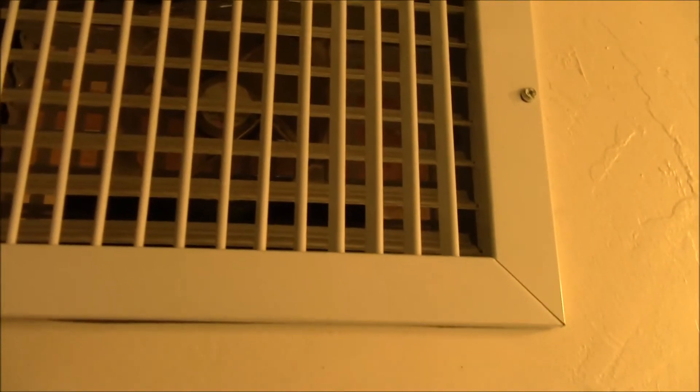I have the vent over the door — there's the door frame and the two fans. That helps the heat because I used to get a lot of hot air trapped behind this point. Hot air rises, and this area behind the door would fill up with hot air before anything would come out below. Now I have these two ventilation fans above the door that blow the hot air almost from ceiling level out and get it into the rest of the house where it can circulate.